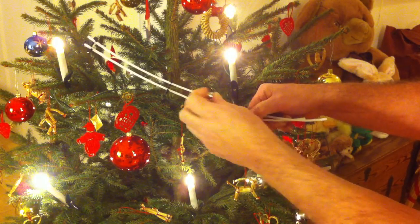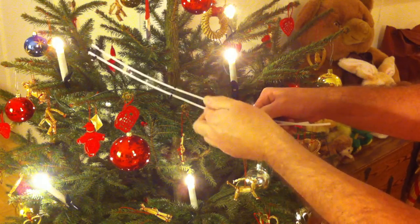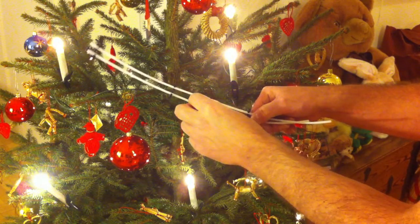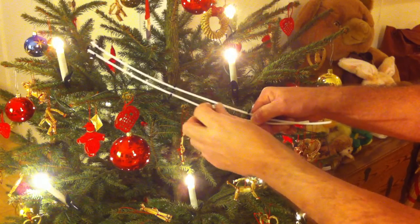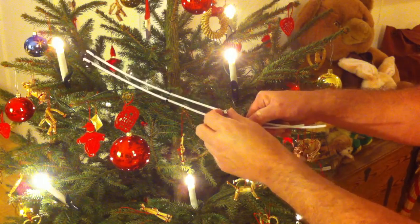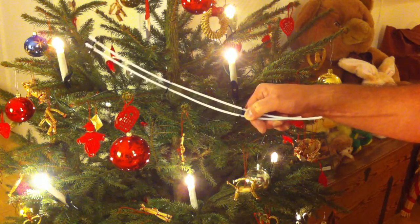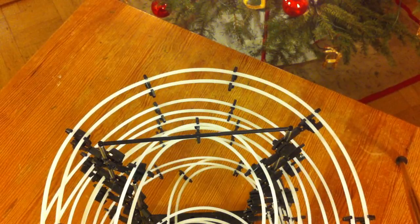In practice there will be some skidding when the ball moves. It can't completely transform its energy into rotation and back into speed. The skidding will cause energy to be lost in friction and heat. The end result is that your ball will not have enough speed. So the ideal situation is that the distance between the rails is constant.